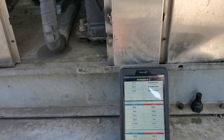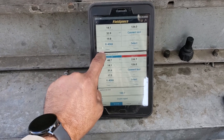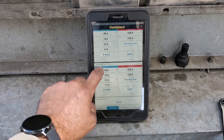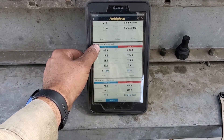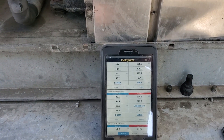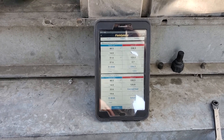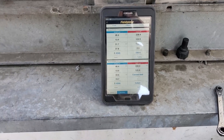How much? That's questionable. But the moment that I start adjusting on my evaporator superheats, we are going to change the compressor superheat. Now, both of my evaporator superheats are running a tad on the high side, especially since my system is at 34 degrees and just about to satisfy. Remember, either way, adjusting the superheat — more or less — is adversely going to affect your compressor superheat. So keep that in mind.